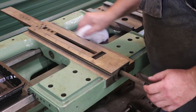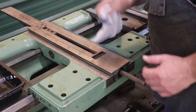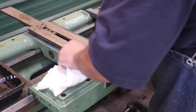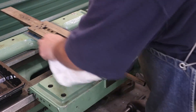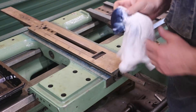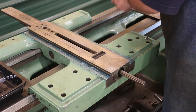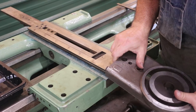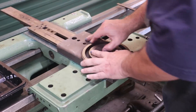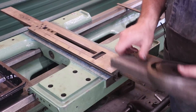I'm just going to spread some on here. That's way too thick, but I'll spread some on here. I'm going to have to do some wiping. Might need to thin that down some. I do like how it's spreading though. What we're going to do now is take this part here, slide it in, and I'm not going to worry about putting the gib in for this — I'm just going to be sliding it back and forth a few times, pull it off and let's see where we're touching.